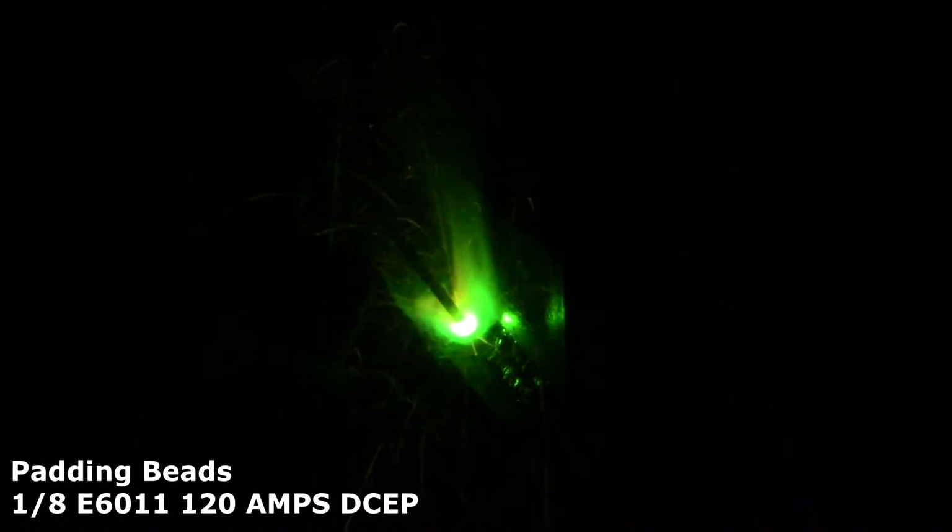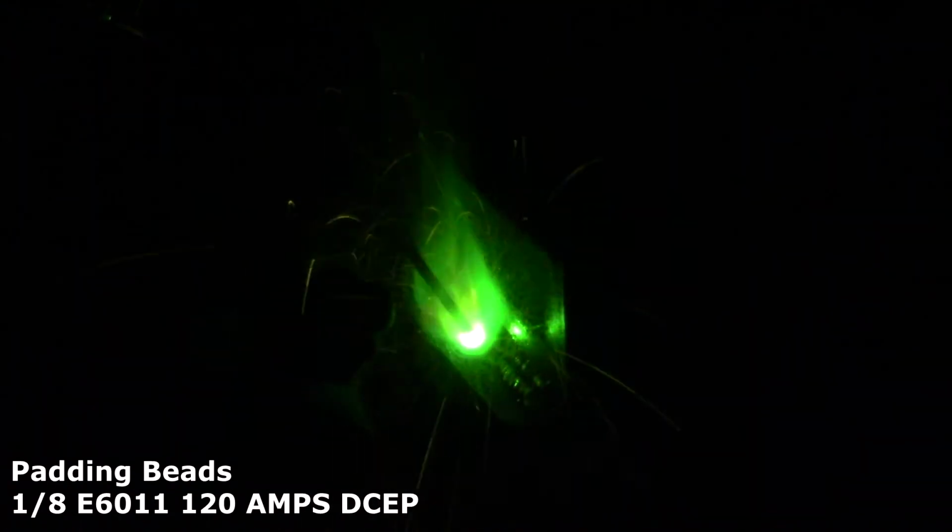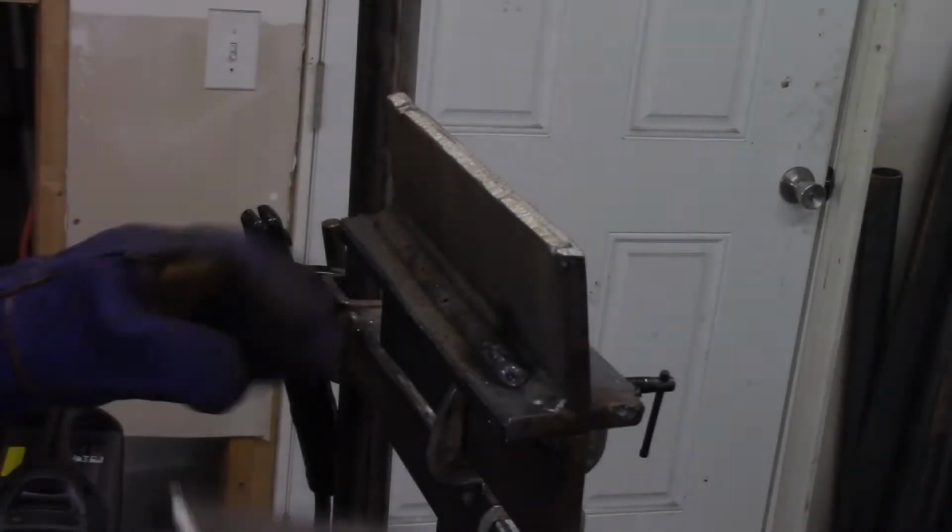For my angle, I typically try to stay more upright. The textbook angle to shoot for is somewhere between 10 and 30 degrees. When I'm welding my best in the flat position, my electrode angle is around 10 to 15 degrees. For quick reference, I keep a chart next to my welder in case I forget these details.